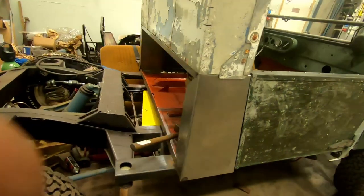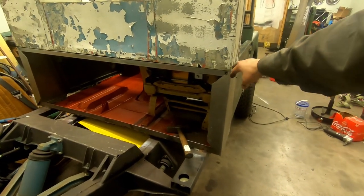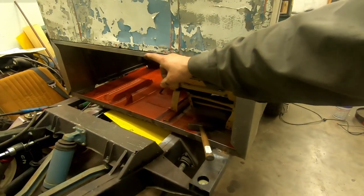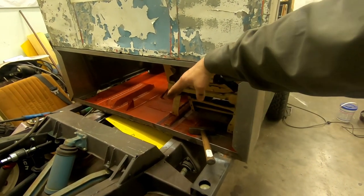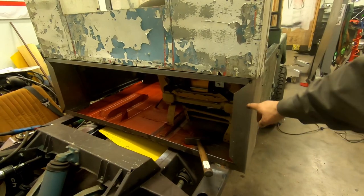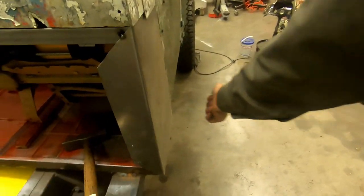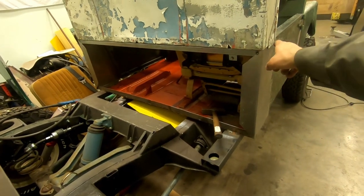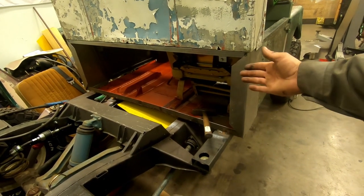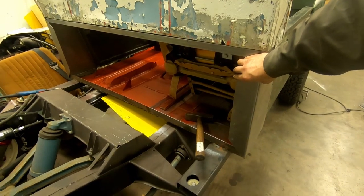And I will now build a bar from this one down to the floor. Same on the other side. And just one diagonal over. I will not make a cross. I don't think I have to. I mean, I'm building with quite thick steel. These are 1.25 millimeter thick, so quite a strong rear wall, but I will make one diagonal, just to prevent movement like that, shaking.